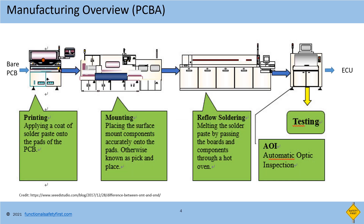The picture shown in this slide explains the high-level process of manufacturing for SMT devices. Through-hole devices use a different soldering method. Here, manufacturing starts with the bare PCB board, which will be pre-printed with the hardware layout intended for production. After inspection of all the required parts, the correct PCB board will be inserted. Then, soldering paste is printed over the bare PCB board. Printing of this paste is based on the hardware design layout, which is also called as Gerber in the manufacturing world. Soldering paste contains soldering material along with adhesive paste to make the components stick on the PCB surface and not lose hardware components during the manufacturing steps.